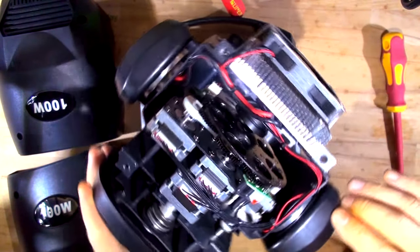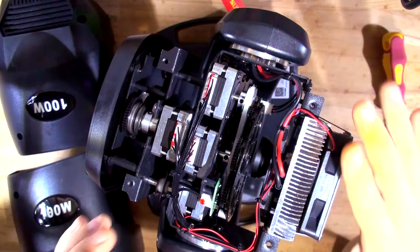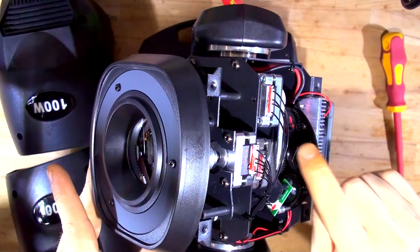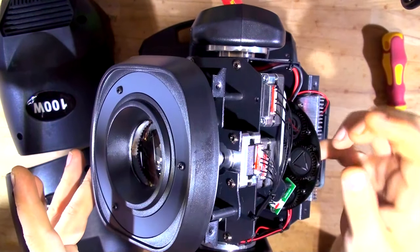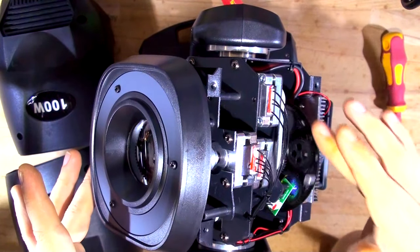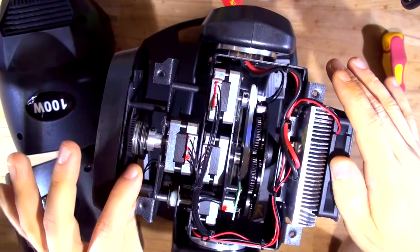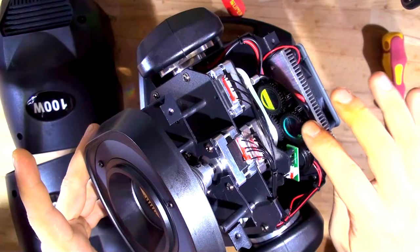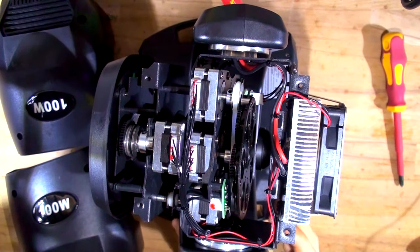Okay. Now that we had a look here, we've got all the sensors, hall sensors. Yeah, Shehds, I know you're probably watching me since you're the sponsors. Maybe next time, don't glue your gobos in. Make a little spring. First you'll save on the glue. This way the user can actually pop the spring out just like other lighting, get the gobo away and put their own gobo in and then put the spring back in. It'll be more convenient for people to put their own gobos. Maybe someone wants to put their own logo in there or something. So that's a good idea to improve the light, just make the gobos removable and swappable. Now, let's have a look at the sides here, like how they're running the wires.